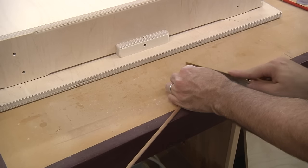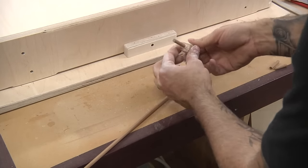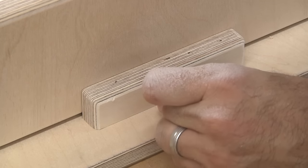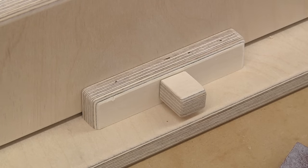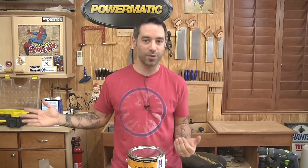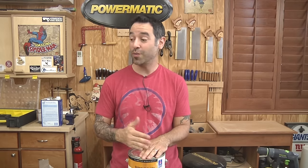To make the pin handles, drill a couple of quarter-inch holes on a small strip of scrap and then cut them into little squares. Cut a quarter-inch dowel to 1¾ inches long and glue that into the handle. And just like that, the top of the table is locked in place. The finish I'm going to use is probably more complicated than you'd want to do, but ultimately all you need for the table and chairs is a nice coat of paint. Just get a brush, your favorite paint, and slather it on. It doesn't have to be complicated — get the kids involved and let them have some fun with it too.